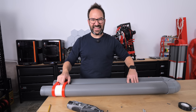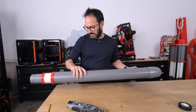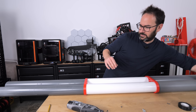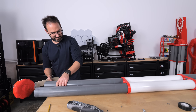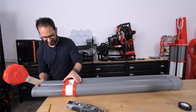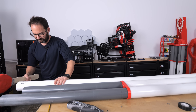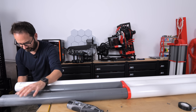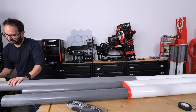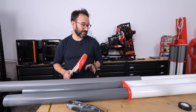Give me a second. I made this quick test with half the bends. The bend is made out of PVC instead of 3D printed parts, and it can be extended in three sections, just to see if it improves. There is a slightly better sound, but it's not even close to a single straight pipe. Even with just one pipe inside the other, it sounds way better — by a lot!